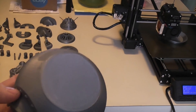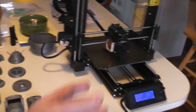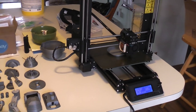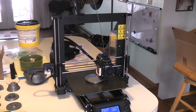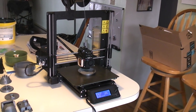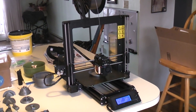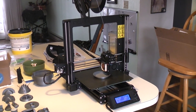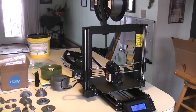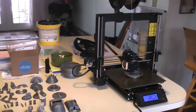This is a part that I have test printed successfully on my Anycubic i3, so I know that the STL file is fine. The Anycubic uses Cura, so it's sliced differently. Here I'm using all the latest downloads from Prusa, and I'm not really sure what happened. Way back when I ordered this machine, it was in the hopes it would have all the things they were showing at the trade shows — the nicer build sheet. I believe that line represents an actual filament jam, and at some point the dual extruder drive was able to break whatever jam was on the reel loose and started printing again. If it had been a hot end jam, it wouldn't have cleared itself.